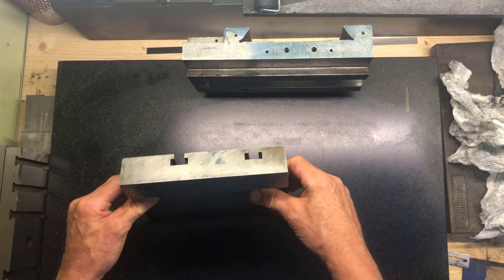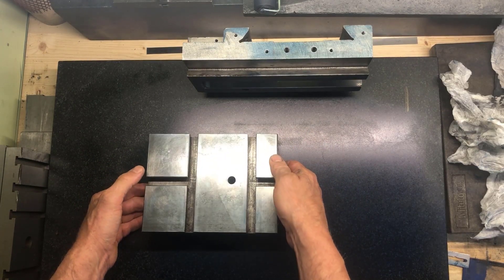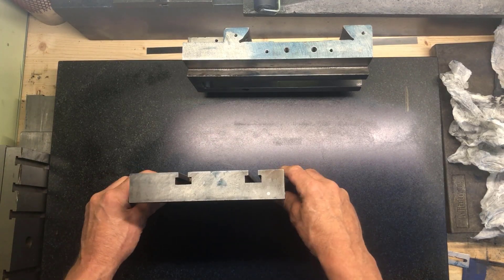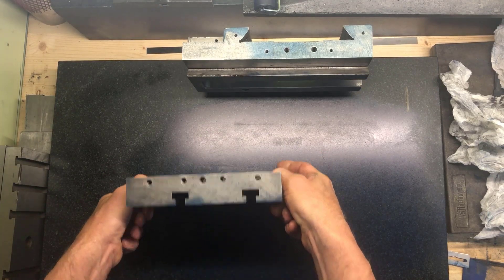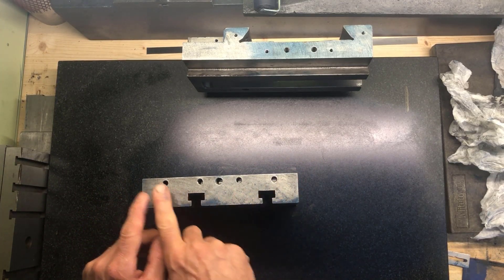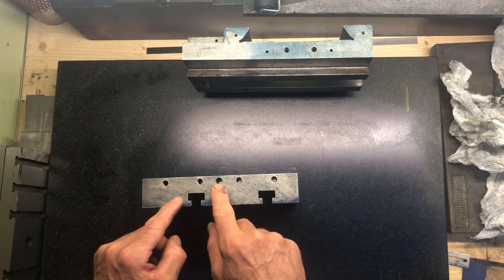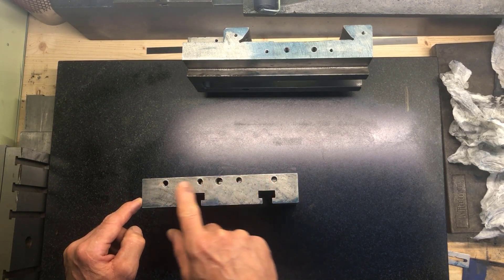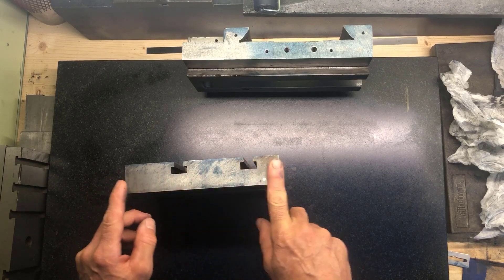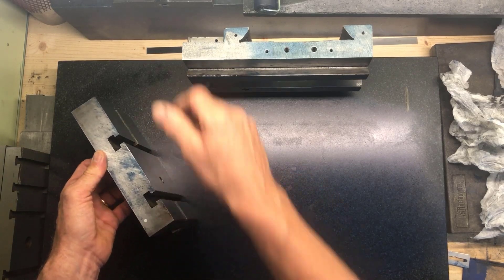But from a geometric or machining point of view, I find that the top of the cross slide is totally flat and accurately machined. It will rest sufficiently well. This should tell me that it is probably a little bit out, but not much - you have a milled surface here that is flat. The same here, and it covers a lot of the surface. So all that remains is to see whether or not it is square.